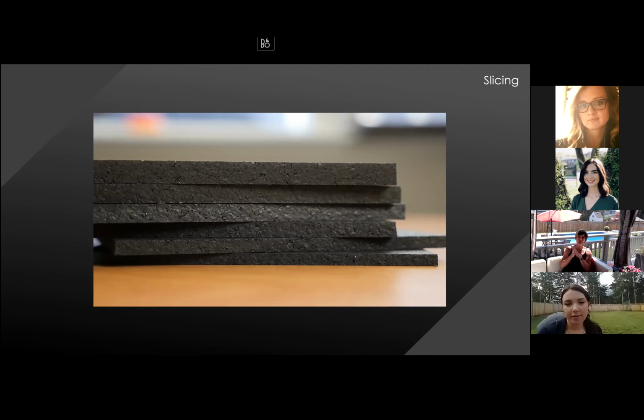And the gentlemen that are at the factory, and ladies, we have ladies working there too, that are cutting the product, use calipers and they measure each mat on each corner as it's coming off the slicing machine. So we have a really tight QA/QC process in place. That way you're not left with uneven tiles that are going to show any kind of seams or defects once it's installed. Very true.